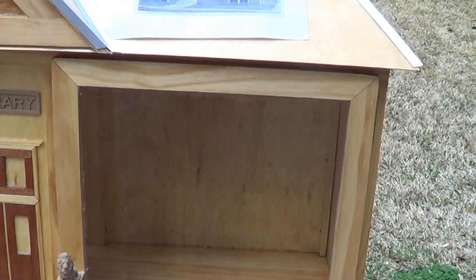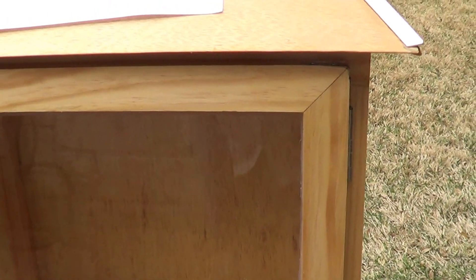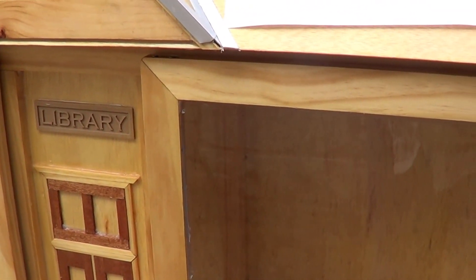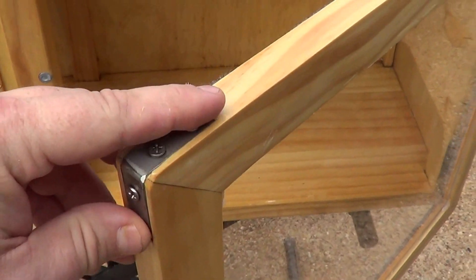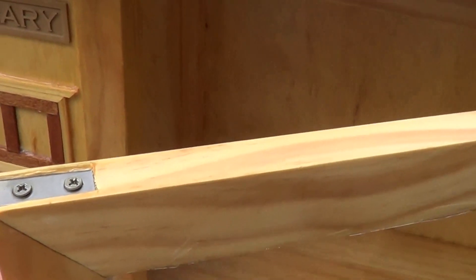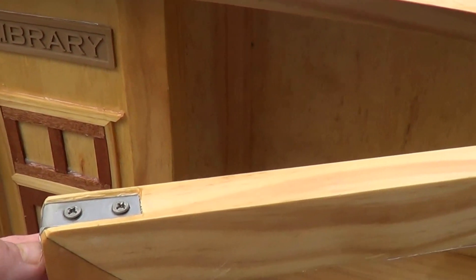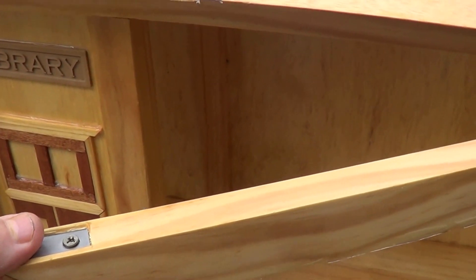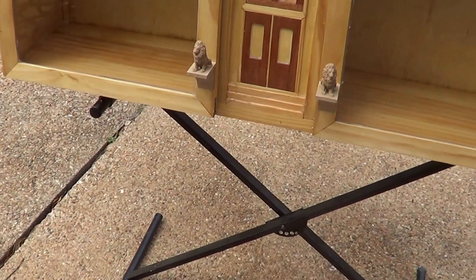I think the doors were the first thing I did, just because I had the glass and I had a miter saw. So I ended up mitering the corners, and I kind of regretted that decision a little bit later — I kept worrying about the strength. They look kind of nice, but they're not the strongest. So I ended up doweling the tops, but then I got concerned that the dowel rods weren't long enough. In the end, I decided to put some stainless steel corner braces in there. One thing I'm not a big fan of is the braces weren't countersunk, so the screws stick up from the top. I went from making this a quick project to a fine project, so I just kind of went with that.